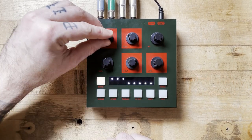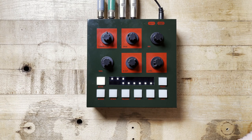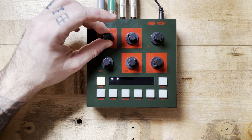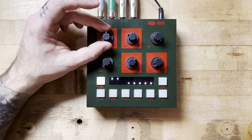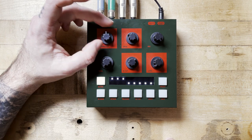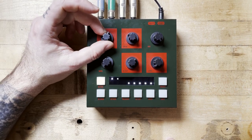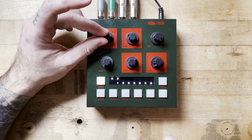On the front we have a one-knob compressor. Basically what this does is control different parts of the compressor circuit depending on position. Let me open the manual: it controls the threshold, the ratio, and the makeup. So when it's at the minimum it's one-to-one — basically no compression. Up to the midpoint it's going to be limiting, infinite compression after the threshold, ranging from five-to-one up to ten-to-one. Past the midpoint it goes negative — it's an over-compression that creates a dynamic reversal effect, which is very interesting.